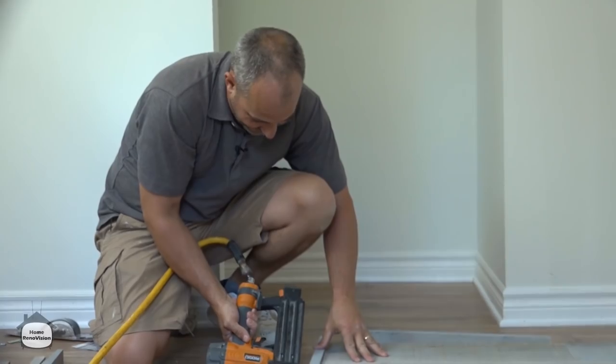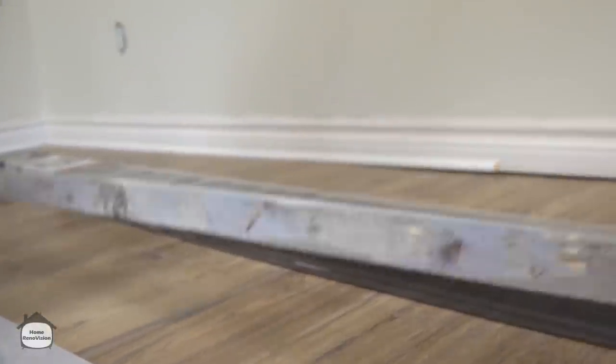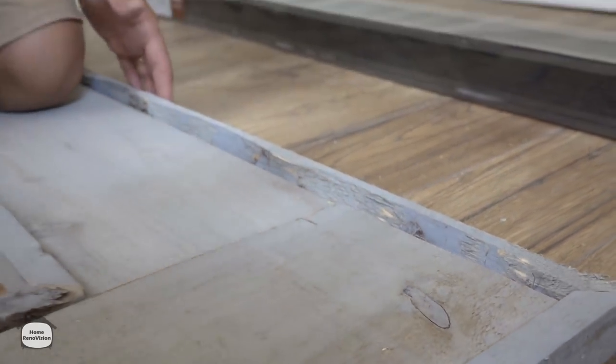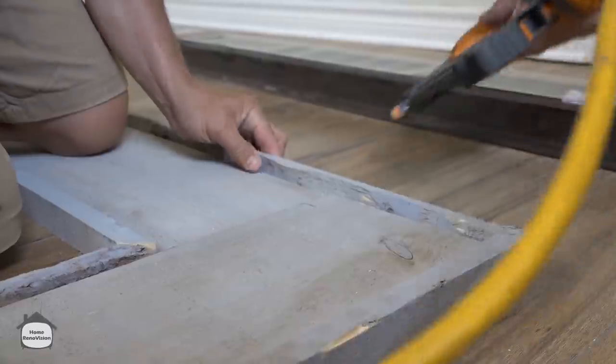This is unique in every sense of the word. There's a board here that's kind of a screw-up - it has a live edge look - but the back side is still 7/8 wide and I'm going to use it because I love the character in that piece of wood. As long as the outside dimension of what you're building still works out, why not use something that would otherwise be a reject. These rail systems are basically designed for an 8-foot ceiling, so in a basement we have to be careful to cover the hole without going so high that the hardware won't function.